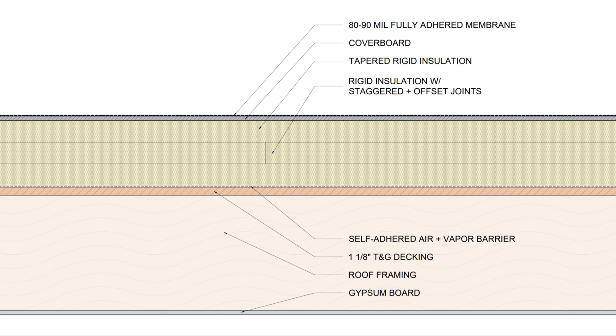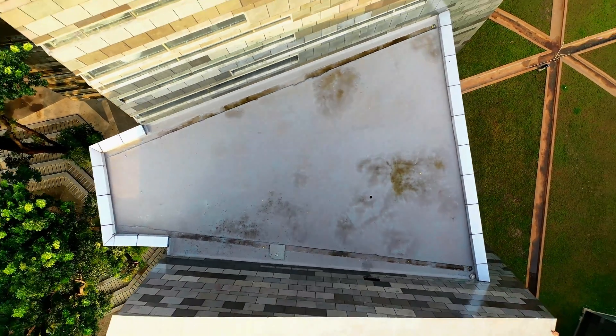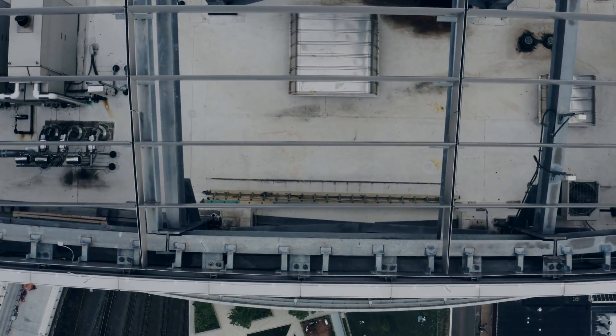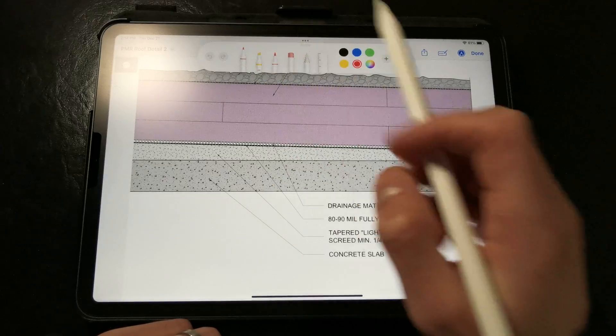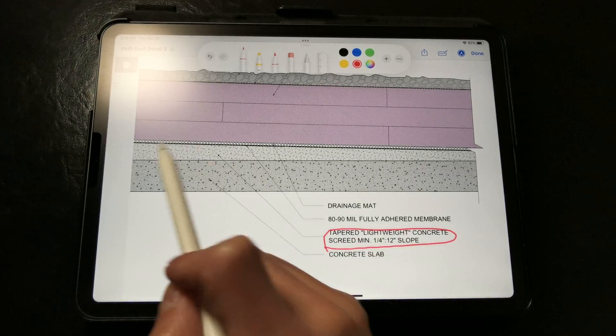This strategy has been used on many flat roof systems and for the most part it works, until the roof membrane has aged or deteriorated to the point where it's time to replace it — which can greatly vary depending on the type of membrane specified, the thickness of the membrane, and the amount of exposure it has received over its service life. Rather than using tapered insulation to achieve a slope, protected membrane roofs integrate the slope into the structure.